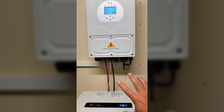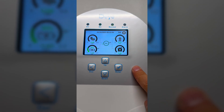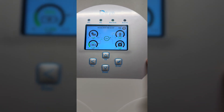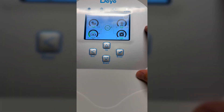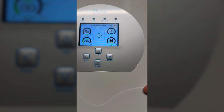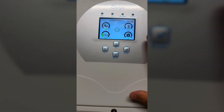I had electricity in my house — I just needed to shut off from the grid. We only have the grid connected right over here, so this is a really simple setup. With AC coupling activated, which is one of the questions I've been getting a lot, we are putting into the battery anything that the inverter detects, even if the energy is generated by any other inverter on our grid instead of the solar panels.